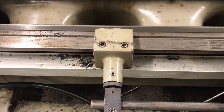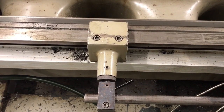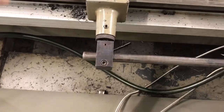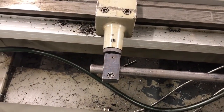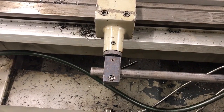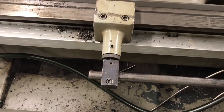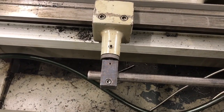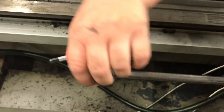When you're not wanting to cut a taper you loosen that clamp so that this whole assembly is free to move. I'll go ahead and check the tightness right here also — it looks like that's a different size, probably the next size down. That needs to be tight also.